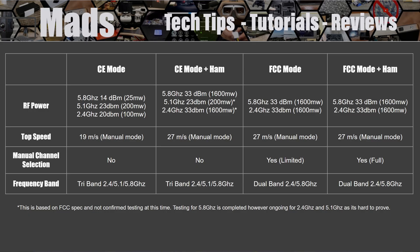The third mode is normal FCC mode, which does allow you to manually select channels. It doesn't have the speed limitation, although it is limited to two bands of operation. You do have the maximum RF power. The fourth and final mode is FCC plus HAM — it is exactly the same as FCC, apart from the fact it gives you additional channels in manual mode: in 50 MHz carrier mode you get three channels instead of one, and in 20 and 10 MHz carrier modes you get seven channels instead of three.